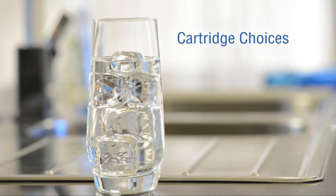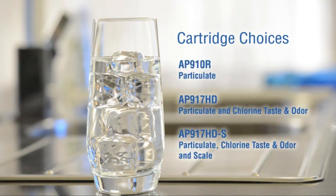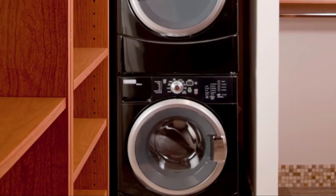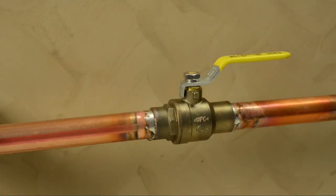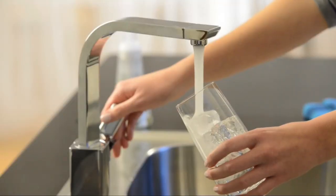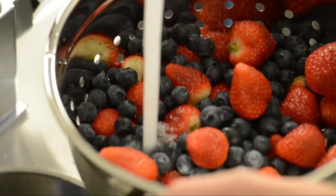The SQC design means you don't have to contact the filter media or need a filter wrench. The replacement cartridge has an activated carbon filter with a nominal heavy duty particulate reduction rating of 5 microns and a 100,000 gallon capacity at high flow rates of 10 GPM and even at intermittent peak flow rates of 20 GPM.